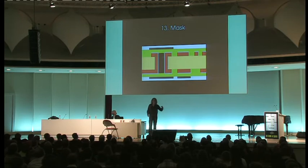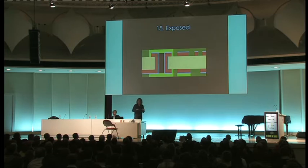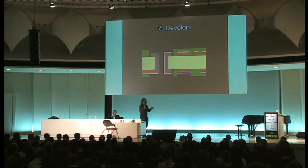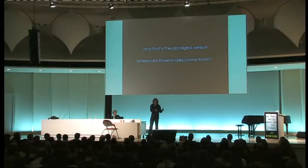Two more masks containing the image data for the solder mask layer are placed on the board and exposed to UV light, chemically changing some regions. A solder-mask-specific developing chemical then strips off the areas you don't want — for example, the areas where you're going to solder component legs obviously need to be exposed copper, so there'll be windows in your solder mask. That's about 16 basic steps — the abridged version — and I also conveniently glossed over where the masks came from: they themselves are the output of another photolithographic imaging process.